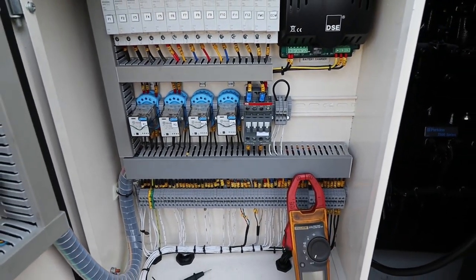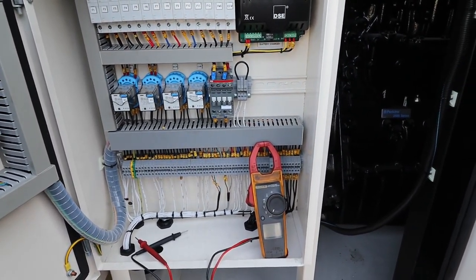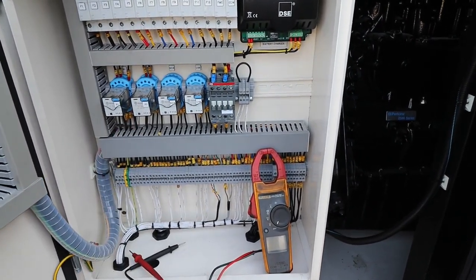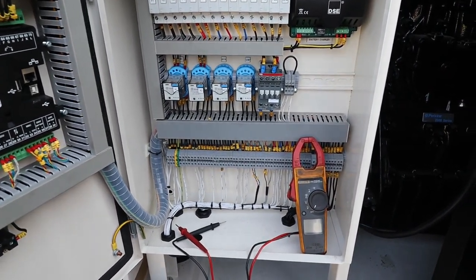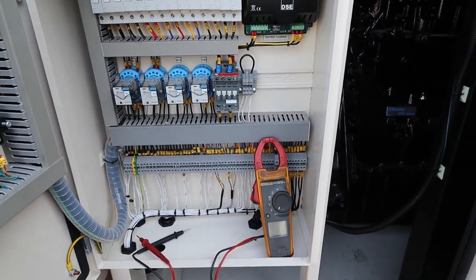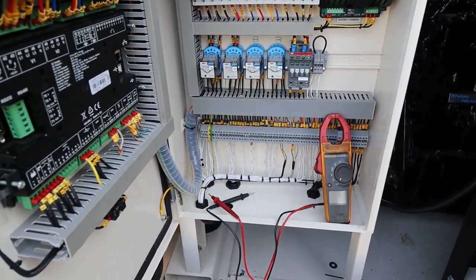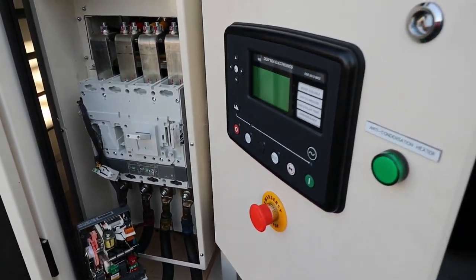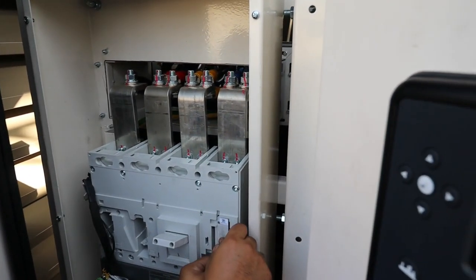It's not active, meaning there is no supply. The third thing we need to check is where the supply is given from for this relay — it is only switching the sides in order to close the holding coil when the breaker is on. Let's see where this supply comes from. This connection is not the problem — only the supply is the problem.